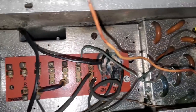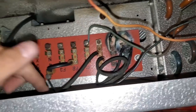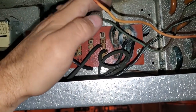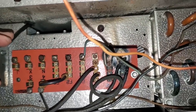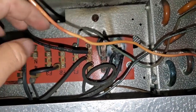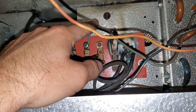Now we're going to do the other coil. If you guys were paying attention to what I was doing on the first coil, you should have been screaming at me because I wasn't thinking straight. I was going to power the fans off of blue and black. The problem is that one of those wires gets disconnected by the time clock so that way it can pump the system down when it goes into defrost. So I can't power the fans that way. So I do have an extra white wire coming down — we're going to use that to power the fans, so the fans will have two constant power sources. The switched leg will be disconnecting the solenoid valve so that way the system goes into pump down.